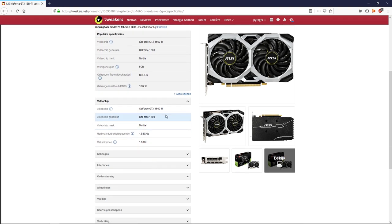It is an NVIDIA card with a maximum turbo clock of 1830 MHz. Keep in mind this is factory overclocked already — there's already some overclock going on in this card, so I cannot push it much further. That is because there is a power limit set in the BIOS, and it differs from brand to brand. MSI has one of the least generous power limits — it's a very strict power limit which means it's going to limit your overclock a lot.